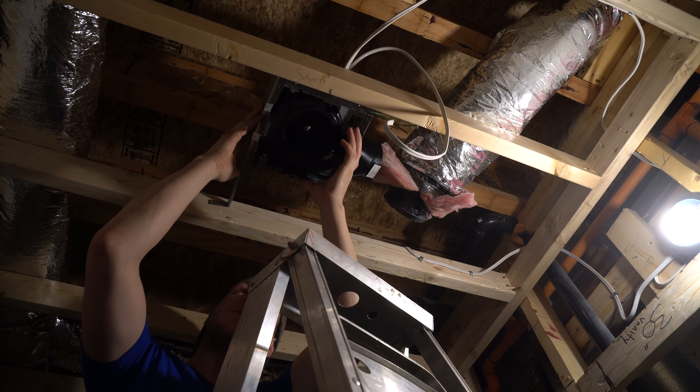Take the rest of the 5/8ths tabs and bend them out. The reason why you're going to do this is that way, when your drywaller comes, he will butt the drywall up. The average drywaller uses half inch. I'm doing 5/8ths because I want a little bit of a separation barrier, and that will also help quiet the sound because it's a little bit thicker. Again, up to you — talk to your drywaller and make sure you're doing half inch if that's what you're using.